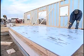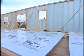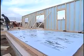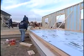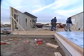The R-value of foam sheathing can vary from about R2.5 to R3 up to R5, which is a typical one-inch thick sheathing product. In some areas of the country, they actually use inch-and-a-half foam, which is R7.5.